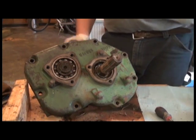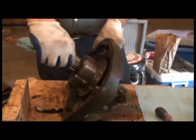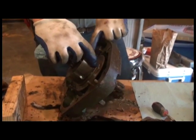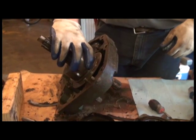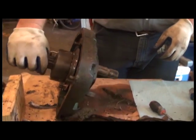And it's definitely something that's required if we need to replace things internal, such as we want to check the springs inside of this assembly, as well as if we need to replace the disc that actually wears against your power shaft clutch brake. So we'll be heading back to the shop press, and we'll show you how to do it there.